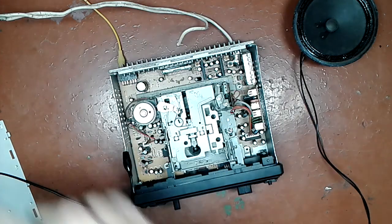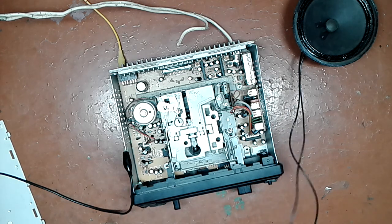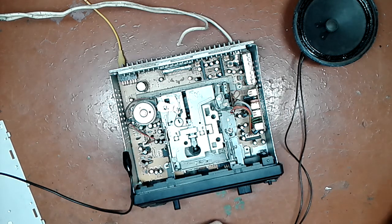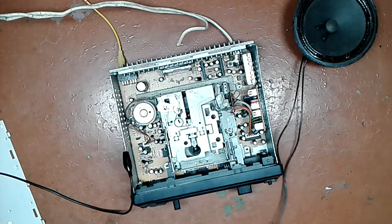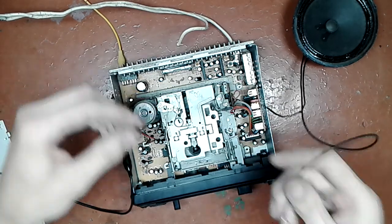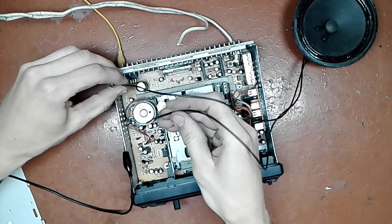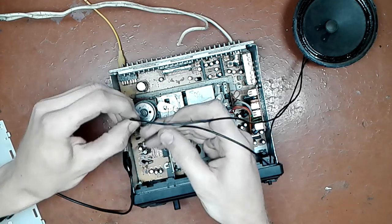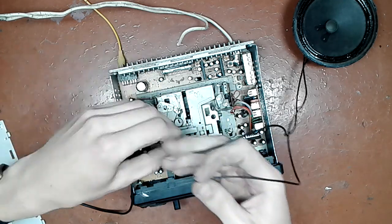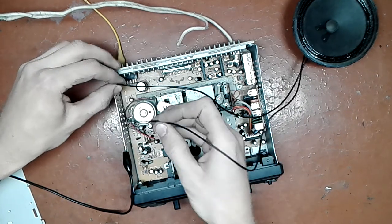You can see a nice piece of wire there. And I'm gonna play a short period of it, obviously. I think you know what a YouTube copyright policy is, and you understand why am I gonna play it for a short period of time. So here we go. Obviously try to not short the output because that will end up in tears. It actually consumes quite a lot of power. Right now it consumes half an amp at 12.5 volts, which is 6 watts. And this heatsink is getting warm doing nothing, without load. It's kinda disgusting, isn't it?